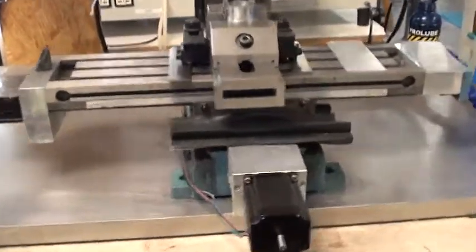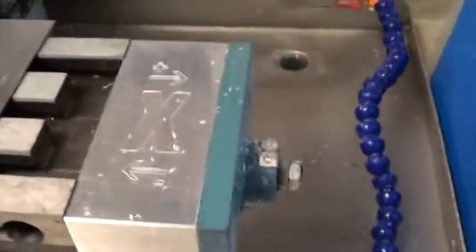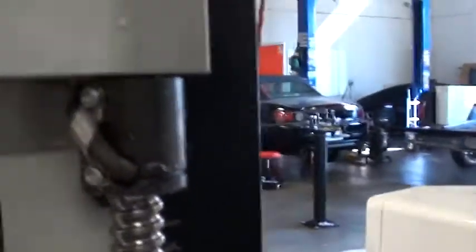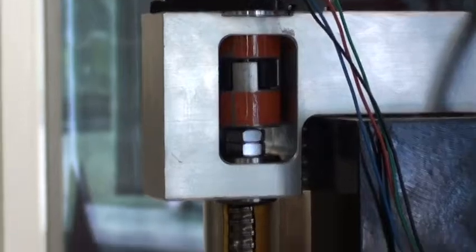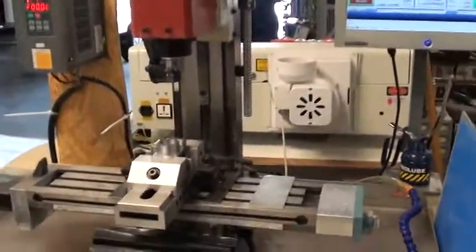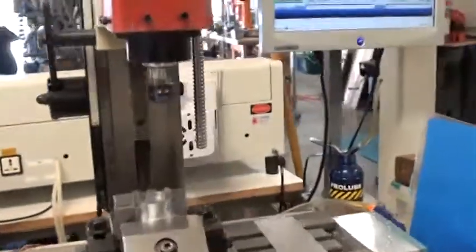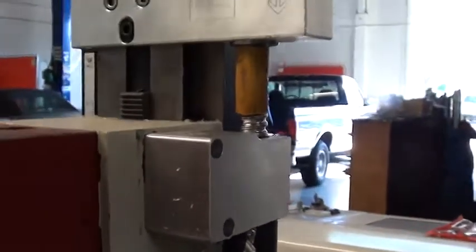The first step in the upgrade was getting a CNC Fusion CNC upgrade kit. That came with the fancy engraved XYZ blocks. They have Thompson Micron ball screws and Lovejoy X50 couplers to tie it into the motor. There's the coupler on the back. The preloaded backlash anti-backlash thrust bearings. All in all, it's a fairly nice kit — a little spendy — but the installation was flawless, very easy. Had no problems getting it adjusted and running fine. I have had debris collect on this screw and it's a little bit crunchy now, but that was completely my fault.